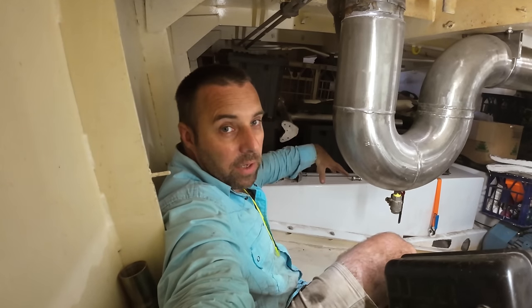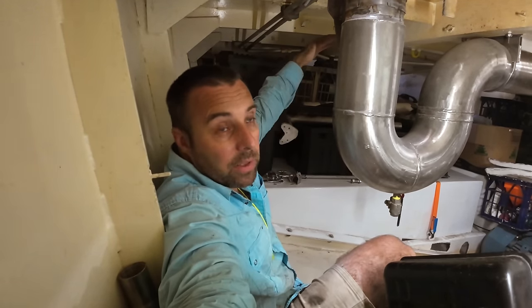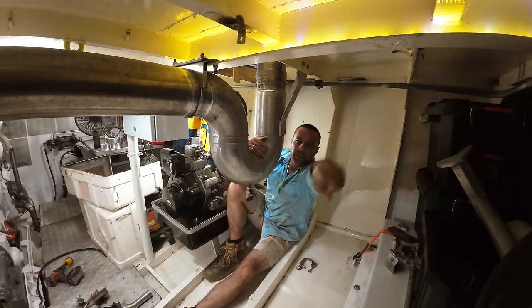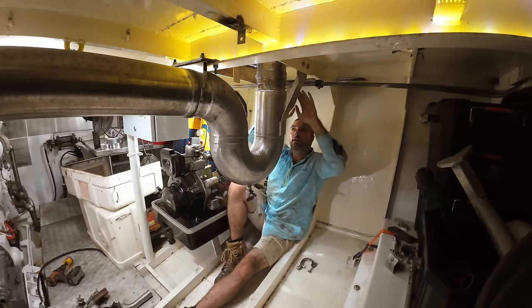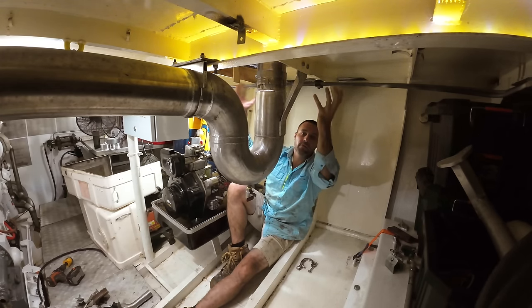So with the air compressor mounted here, we don't necessarily have a lot of space on the lower part, but we have plenty of space up here. So what I'm thinking is mount the compressor in the lower part here, like we did with the other compressor. Mount the big air fan up here, sucking from the engine room and blowing this way towards me. And have the box do a U-turn and be in this particular area up here, so we can encapsulate this whole area of the exhaust.